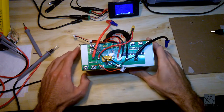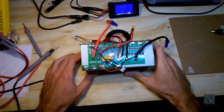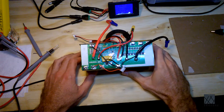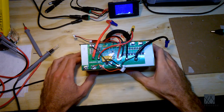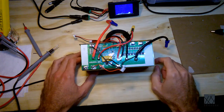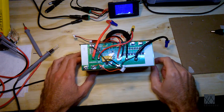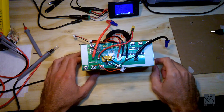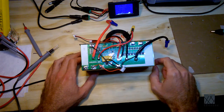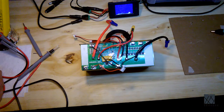And I know that when I get a pack like this, the first thing I'm going to do is check the voltage of the overall pack. If it's in the 10 to 11 volt range, surely the batteries aren't completely run flat, because this is a 3-cell system, and I expect around 10 or 11 volts or more. If I see that, I know all the cells have to be at a decent voltage. However, if I saw something like 6 volts, that's a problem. I would know right away that pack had been over discharged and I don't really want it, or I'm going to have a problem. Maybe I'll have to tear it all apart and just get a few good cells out.